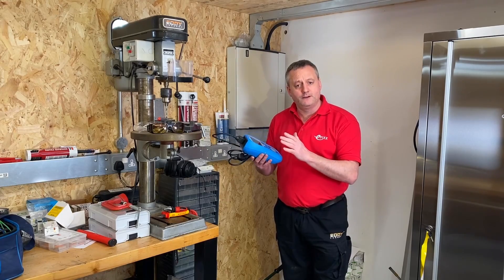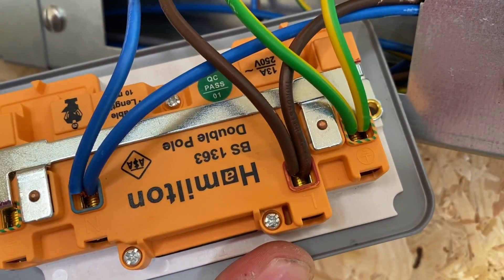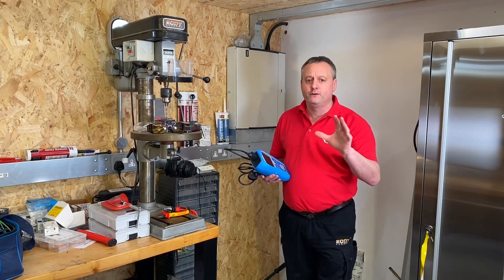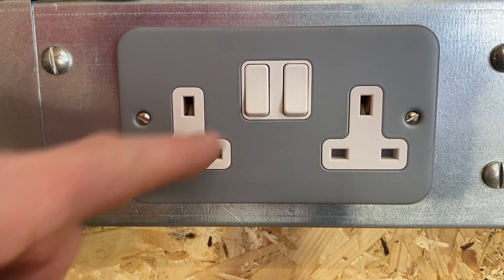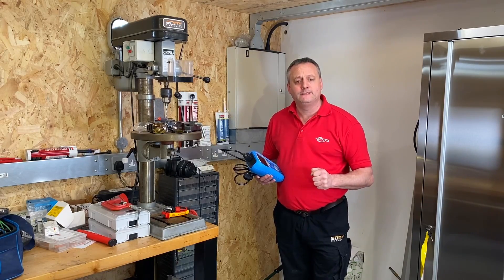You can do this visually — I'd love your comments below if you're the sort of person that does a visual polarity check — however I'm going to use the instrument and prove that all three pin positions on the front of those socket outlets are in the correct rotation: the earth pin, the line and neutral connections. We're also going to prove that the switch operates.